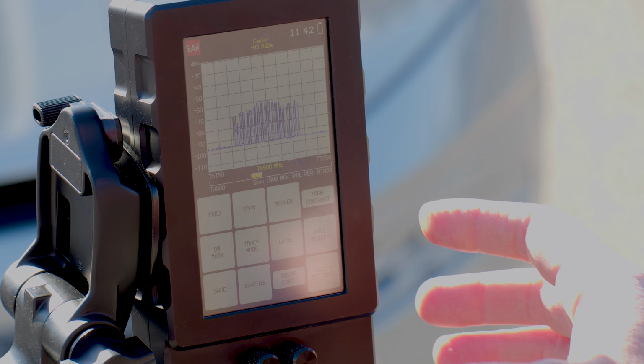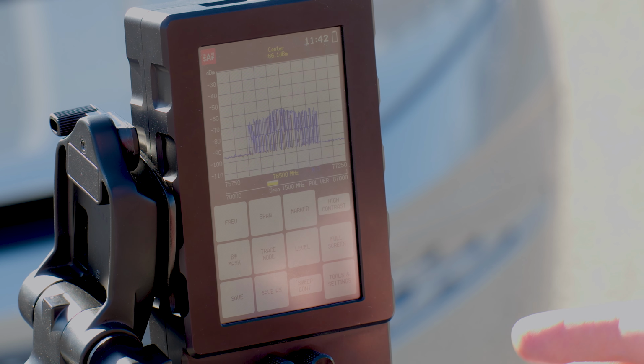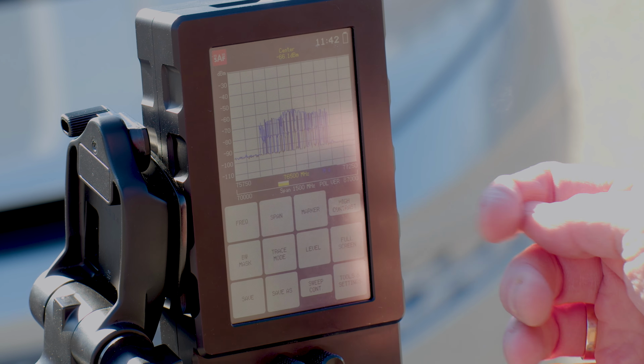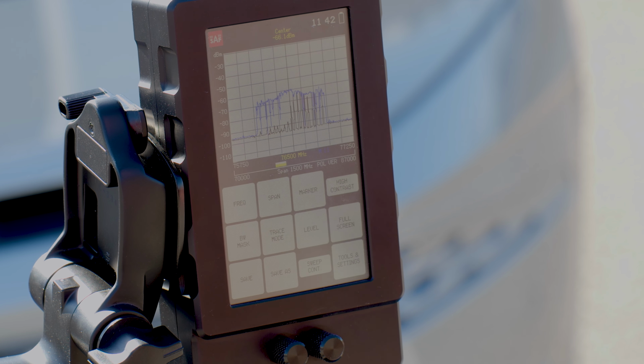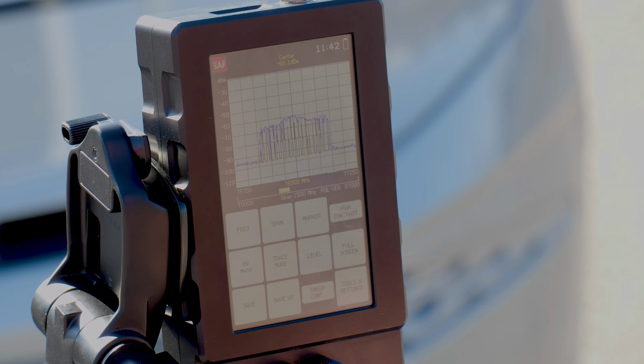With Spectrum Compact E-band, it's possible to do a quick verification if the automotive radar is transmitting. Here we see the signal from the radar in the spectrum. This means that the radar is transmitting. I can place my hand in front of the antenna, which then blocks the signal from the radar. Here you can see that the signal disappears in the spectrum, and if I take my hand off the antenna, then it reappears again.